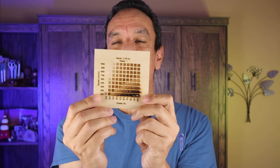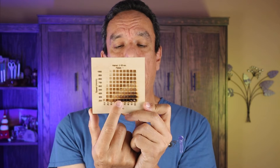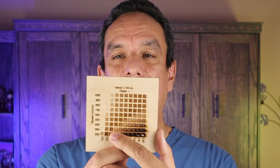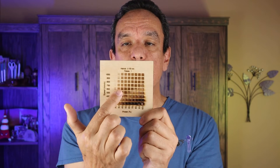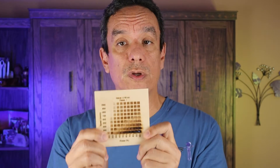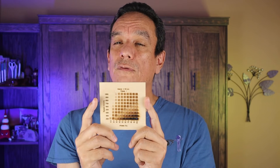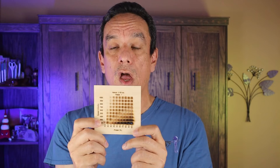This is the test for engraving. I did the test at some really slow speeds and higher power levels — it did not cut through, but the speeds were too slow and too powerful and it just charred the top. You definitely don't want any of those settings. You can look at this chart and decide which shading or color is ideal for engraving. Keep in mind this test is for this particular wood — a different piece of wood could give totally different results. Make sure you run a test for every single product you're going to be engraving or cutting.